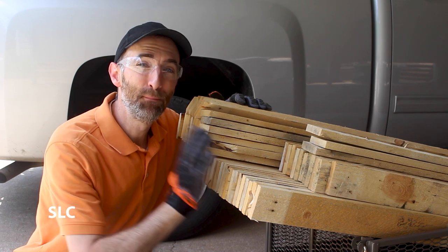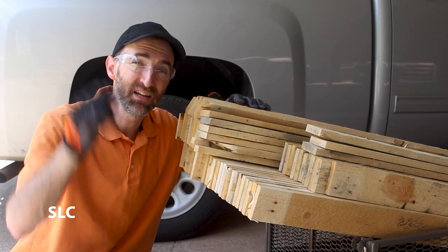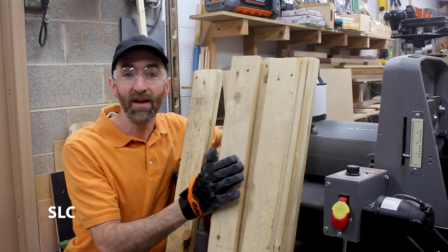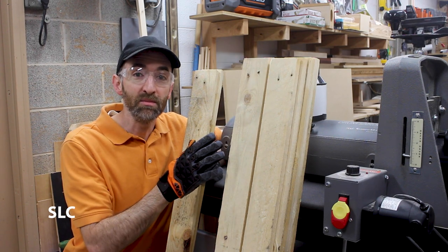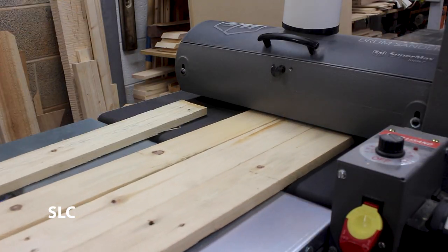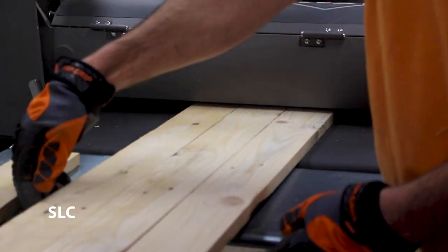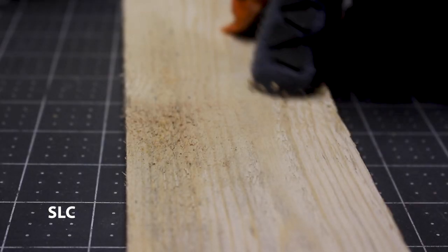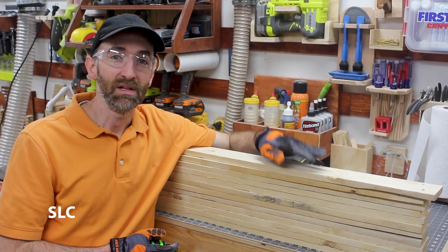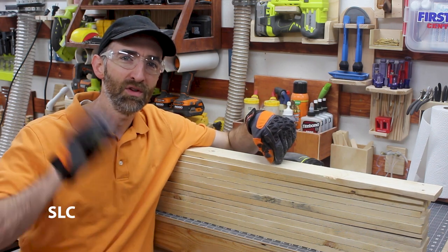After taking apart a bunch of pallets, if I didn't have that little nail remover gun, I'm not sure if I'd want to do it again. I'll put a link to that in the description below, so make sure you check it out. A number of these boards need to be sanded down, especially the ones that I've picked out to go in the seat position. I'm going to run these through my drum sander to speed up this process, but you can always hand sand these. Even with a drum sander, sometimes you have to go back and do some additional sanding. Now that I have all these sanded off, I need to cut them to length — they're about 51 inches and I need 48, so let's take them over to the miter saw.